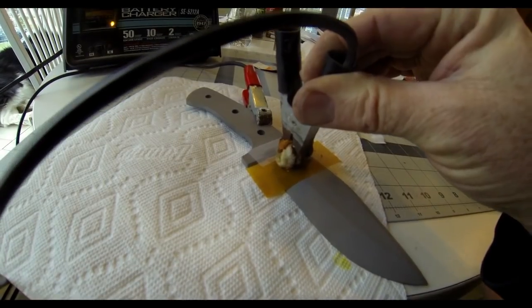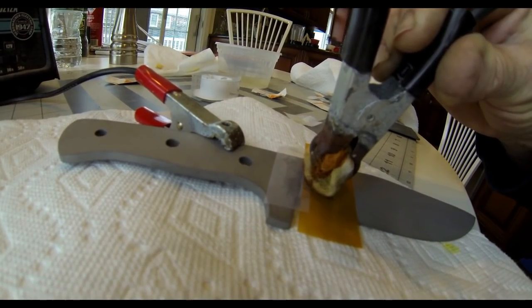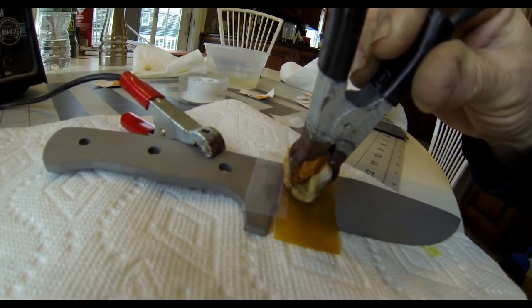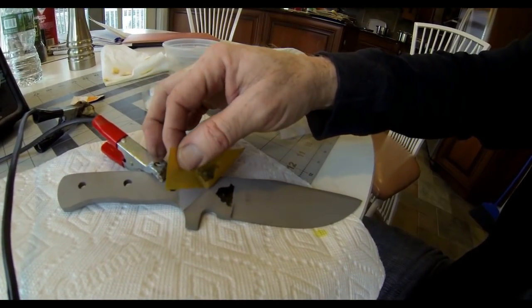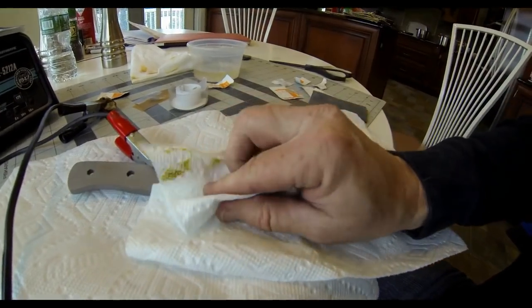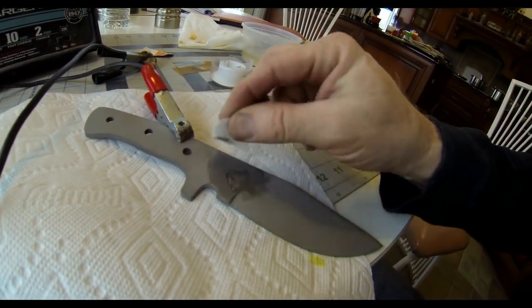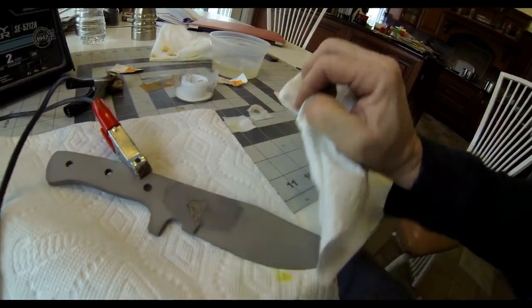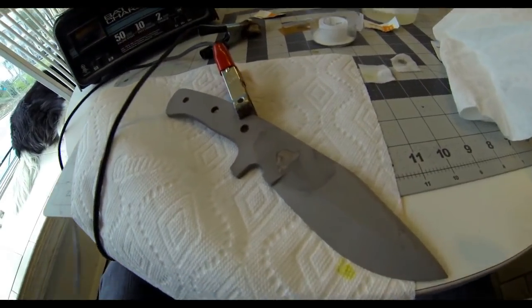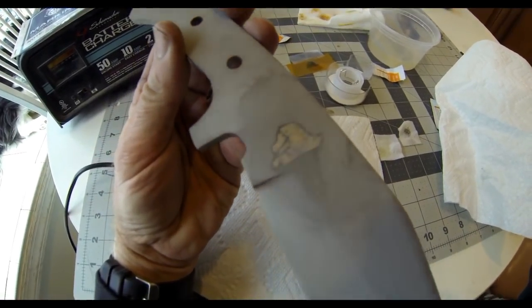The blade is now glass bead finished, and I really like that dull matte finish. I had the bright idea that I still wanted to apply my maker's mark, even though this is a glass bead finish. It's not that clear, polished finish that you normally apply this type of etched maker's mark to. I also messed up on the placement — I placed my maker's mark lower than I would, as if this knife was going to have brass guards, and I realized that as soon as I lifted off the stencil. My maker's mark is a two-tone maker's mark, and I would normally polish it with 1500 grit sandpaper to get all those details to show — but as soon as I rub it with 1500 grit, I'm going to start to ruin that glass bead finish.